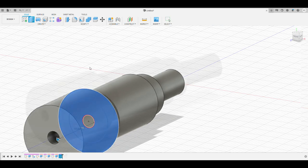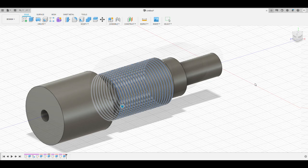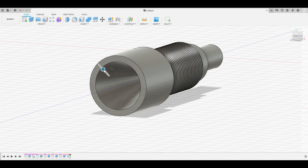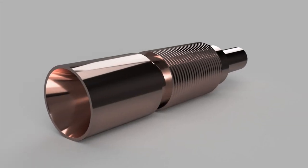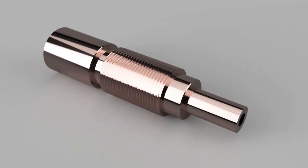The model's very simple with a set of concentric surfaces. I've isolated the threaded section with a groove to make it easy to cut the thread using a single point tool. As I'm only using Fusion as a way to visualize how this thing looks and to produce drawings for manual machining, I'm not going to get into a silly level of detail. It looks quite pretty in this render — pity I'm not good enough at machining to make it look like that.